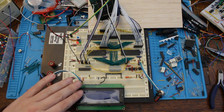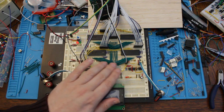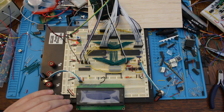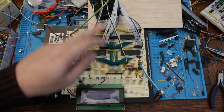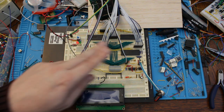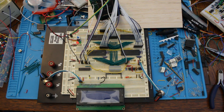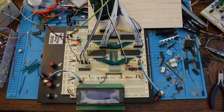The changes I've made to the circuit: I've wired up eight bits of address bus to each ROM chip and tidied up that wiring because it was getting hard to add additional wires. I've also replaced the rainbow ribbon cables going to the ARM board with custom-made ones - just white colored with blue indicating the data bus and green indicating the address bus.